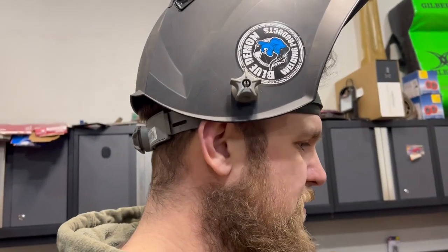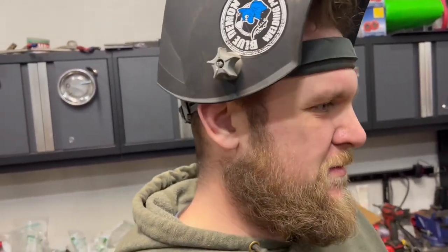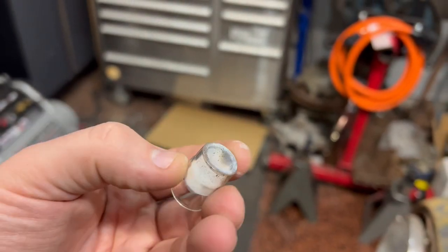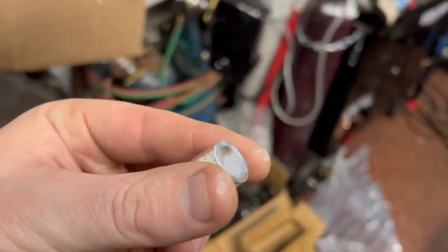Well, if you ever mess up, I know you do. Dave, Steve, I know you messed up. Well, I messed up. I tried welding with my TIG torch with my gas off. Zero argon. It's supposed to be 100% argon. And that's kind of what happens when she flashes up on you. She gets all chalky and gross.